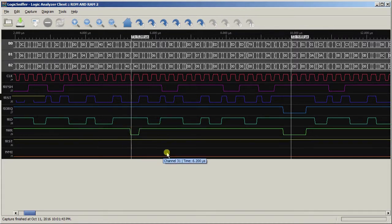And then you'll notice over here, the I/O is high, so it's disabled. The memory request is low, so that's a memory write. And over here, the I/O is low and the memory request is high, so that's an I/O request. So basically, memory address 0000. Well, at the moment we're ignoring this high address byte here. We're only reading the bottom one. So 00, that is the port A.